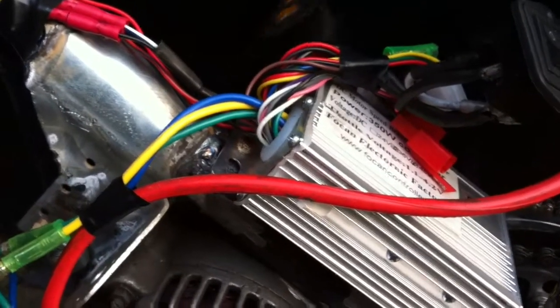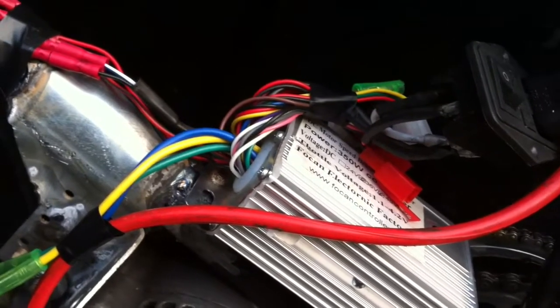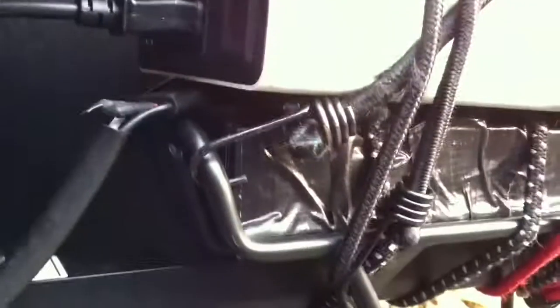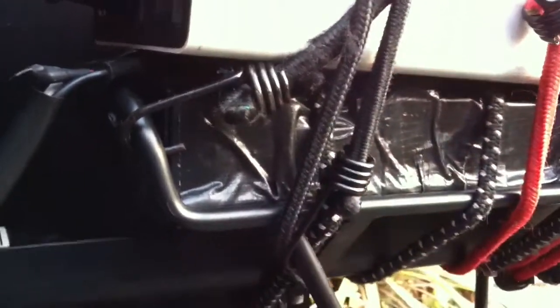I do know the controller I've got does not do this, so we'll see what happens. The next step is to do the PWM and put a three-phase rectifier on this to get rid of this piece of lead. Then I can double up my battery packs and run two batteries down to the controller I used on the BMX.